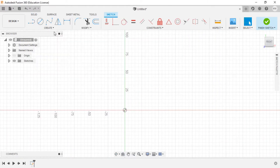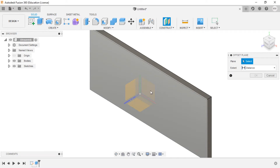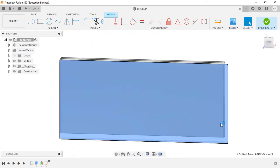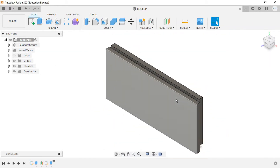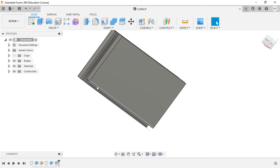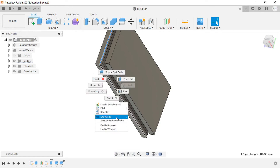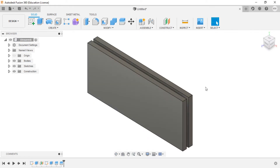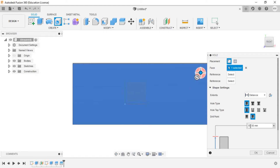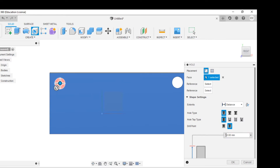To build that custom frame, all I did was take one piece of wood, cut it in half, and then lay the two halves on top of each other. I don't trust that I can cut one piece into two perfectly identical pieces, so I laid them together and screwed them to each other. From there I used one board to trim the edges of the other so I'd end up with two identical pieces — you can see that with the red circles here. Now with two identical pieces of wood screwed together so they're guaranteed not to shift, I drilled the holes for the all-thread to mount the front and back axles of the scooters.